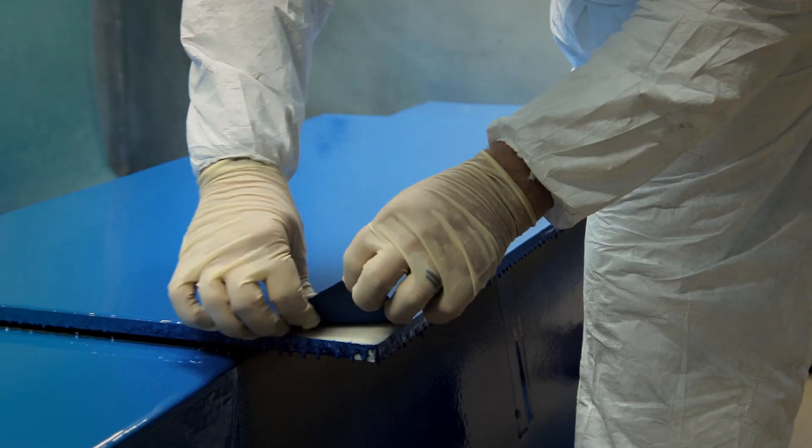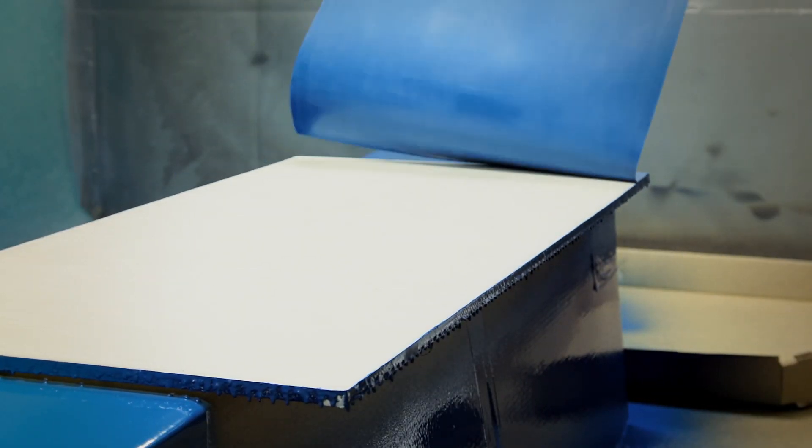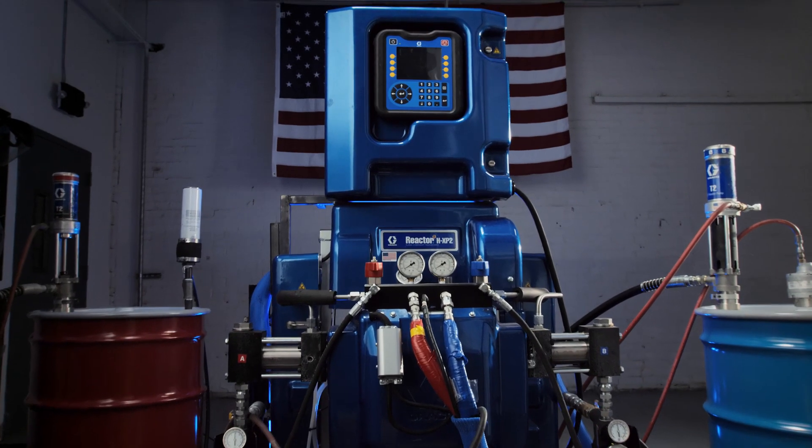Hydraulic oil and internal and external filters — this is just like replacing the oil and filter in your car. We recommend changing the hydraulic oil every 1,000 hours of use or at least once every 12 months.